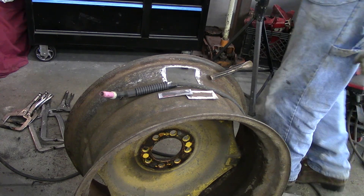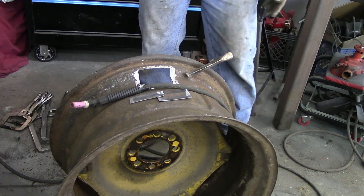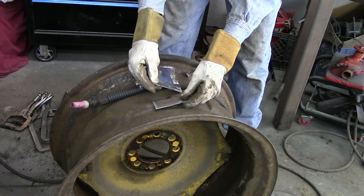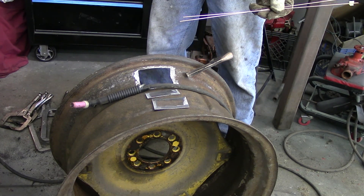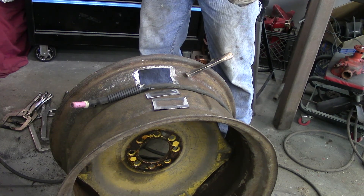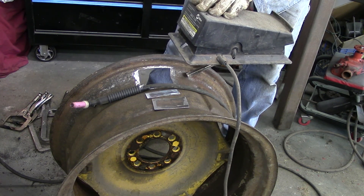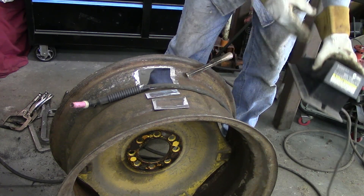My machine is a Miller Dynasty 200 DX, which is good for aluminum, steel, or stainless steel — basically you can weld anything with it. It goes up to 200 amps maximum. I've got my two pieces all cut up and cleaned up a quarter inch back. You want to clean all the rust off at least a quarter inch back from where your weld is going to be. I radiused them a little bit — didn't take much. I've got two pieces of 3/32 filler wire, I'm using ER70S-2 filler wire. I'm also using a foot pedal which operates my welding machine — the further I push it down, the more amperage I get, up to a maximum of 100 amps.